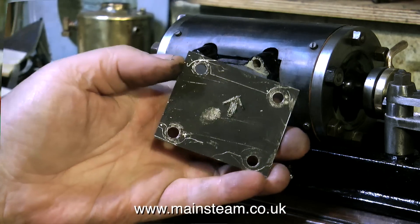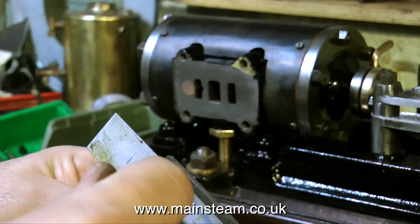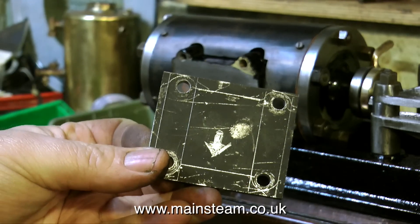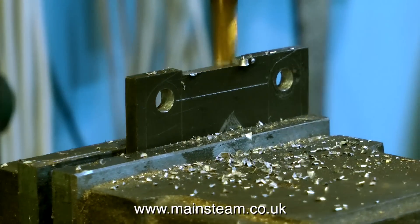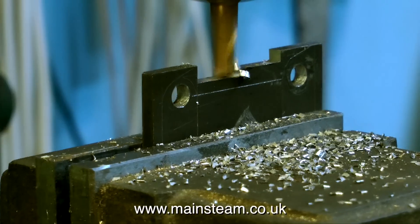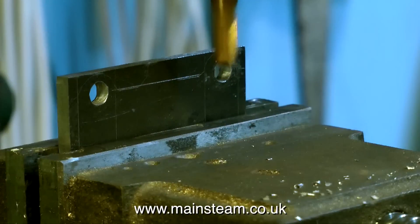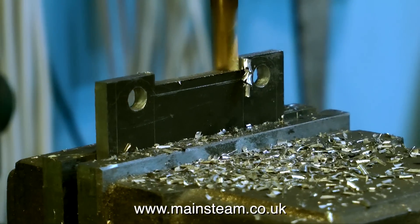I have to make the steam chest cover fit the existing components, and here I'm just truing up all the markings ready for machining. Once I start the milling machine process, I do not wish to get it wrong, so I'm making sure that the scribe lines are extremely visible so that when I start milling I know where to place the cutter. The milling machine process is shown speeded up just to keep it going, otherwise it gets very boring and very tedious. This is not a CNC milling machine that runs at high speed - it runs quite slowly and I have to wind a handle.